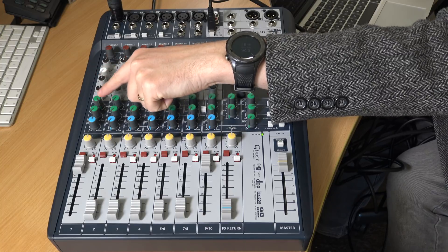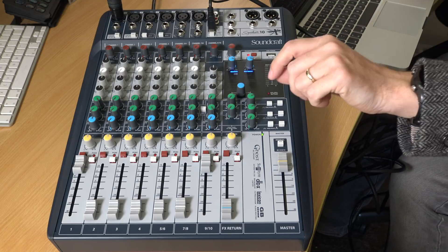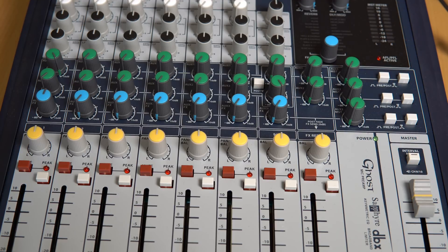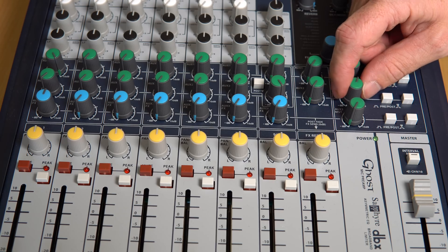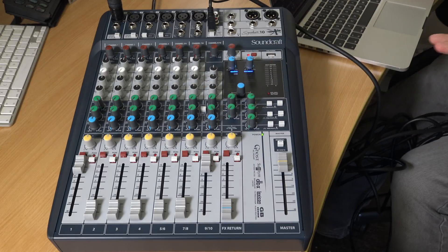There's something you're really going to like — taking it even further with the Soundcraft Signature 10 in particular. That is splitting out your audio — your host audio and your guest audio — onto separate tracks so that your podcast editor, or yourself, can do all that mixing: fade out the guest if they cough while you're speaking, all that cool stuff. That is done by using the aux sends. You want to send your microphone out to aux send one by turning this knob up, and send your guest — which is the computer audio — out on aux send number two. Make sure aux one and aux two master are all the way up to zero, and select post-fader. The reason you want post-fader is because then the aux sends will relate to what you do with the fader, whether it's open or closed, as opposed to the green dials.